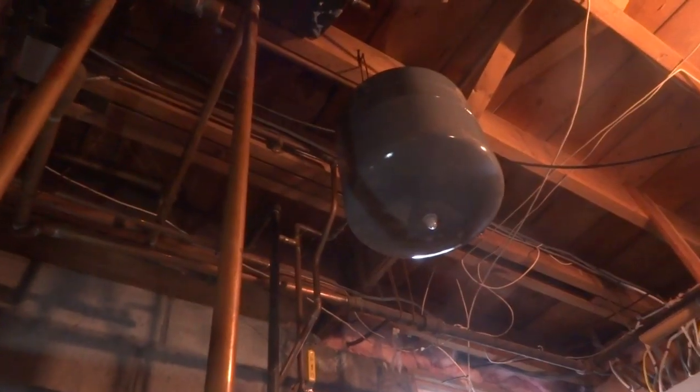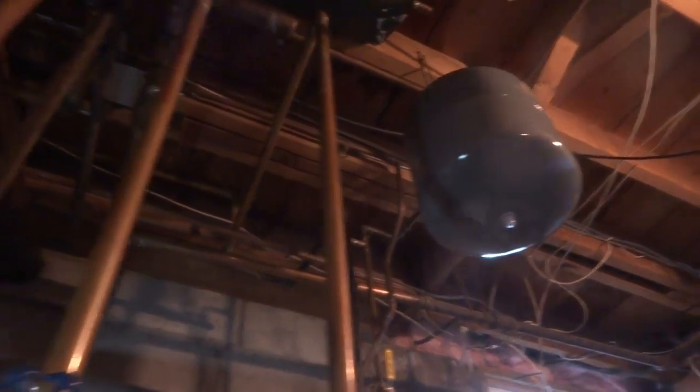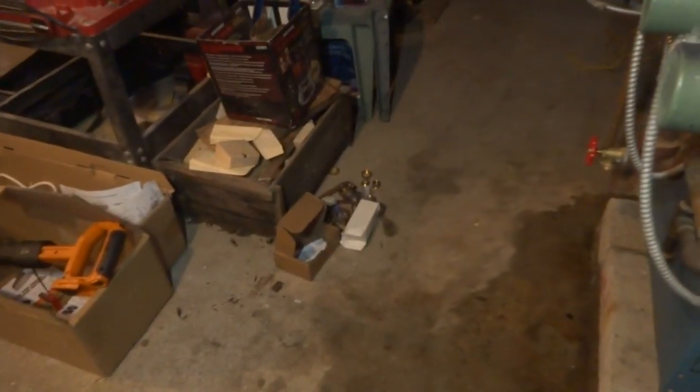Well, it hasn't let loose, and I think we're going to be okay. That tank is questionable — whether I should have went with a 60. Because he's got cast iron baseboard upstairs, which has a little bit more volume than regular copper fin. That's when you need the bigger tanks — when you've got more volume. But it's only a one-inch loop, so I think we're going to be okay. I'll leave the parts there and get them billed.